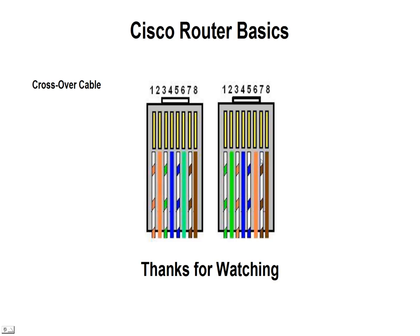Here again are the pin configurations — wires starting with white-orange on the B side and white-green on the A side. All we're doing is swapping one and two with three and six to create a crossover cable. We need this if we want to connect two PCs together to transfer files, or two routers. Primarily this is for two routers. Routers have Ethernet connections and also serial connections, and if you want to connect two routers together with their Ethernet ports, we need to use a crossover cable. Hope this has helped you better understand what a crossover cable is, how we create one, and how we implement it.